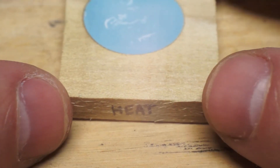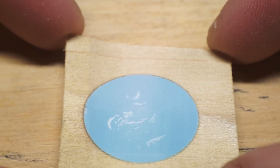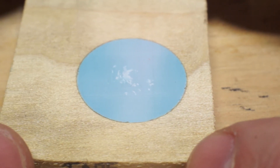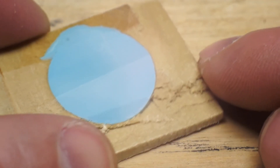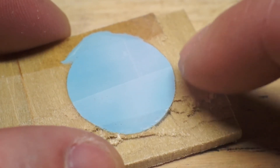And look at this! The first example is the drilled sample that was heat treated. The second is the heat-treated sample with blue tape on the bottom. The third — which had some planer tear-out — was neither drilled all the way through nor heat treated. All three of these look so much better than the first batch. There are next to no bubbles around the edges, and I think it gives us a really strong bond. Heat-treating the channel before the pour made a difference, and at the very least it gives us a better chance that the sidewalls will come out great.